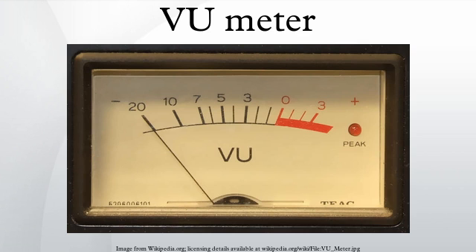The level specification is measured at 1000 Hz. The reading should not depart from the reading at 1000 Hz by more than 0.2 dB from 35 Hz to 10 kHz, or more than 0.5 dB between 25 Hz and 16 kHz. Note that the specification mentions only sinusoidal waveforms.